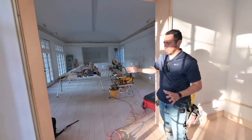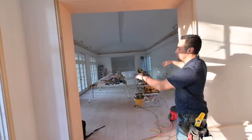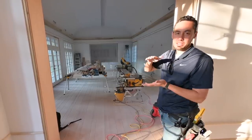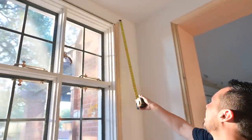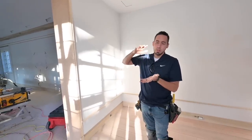As you leave that room and come into this room, this is a more scaled-down room as far as moldings go. We're going to have a three-piece crown that is an exact match of the top of that entablature — those last three pieces we stacked up there. But it's going to be a little tricky because of our reveals above the doors and windows, where it gets really tight. We're going to have to dado and rabbet material out of each molding so it compresses and gets smaller but keeps the same look.